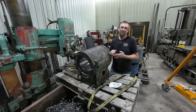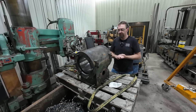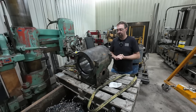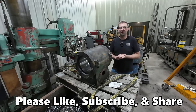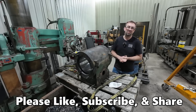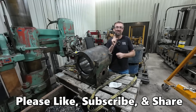With that, I think that answered everything other than a few questions about the tooling and inserts. I've been looking at buying some different insert tooling that would have made this better — I did this job with what I had on hand. A hand grind on a high-speed steel should have worked, but this cast iron is very old and very tough, so it didn't work the best. What did work was a hand grind on a carbide braze tool — that worked extremely well. I will be investing in indexable tools when things pick up again. Until next time, get out in your shop and get it done right the first time.